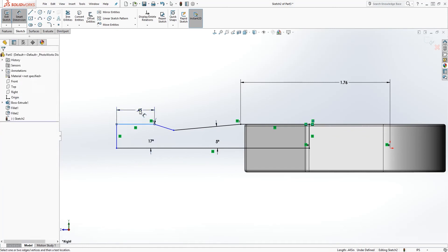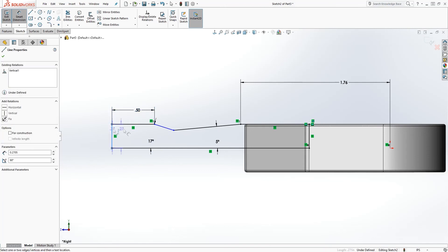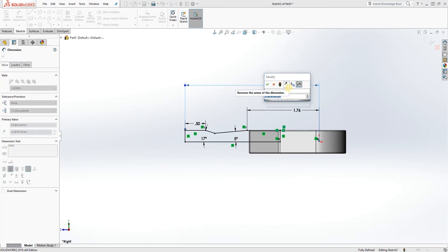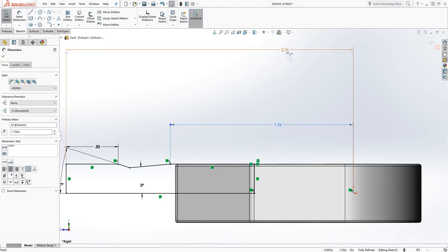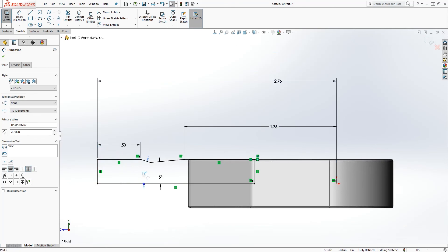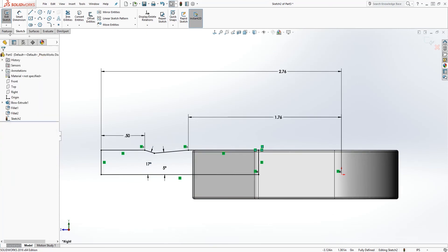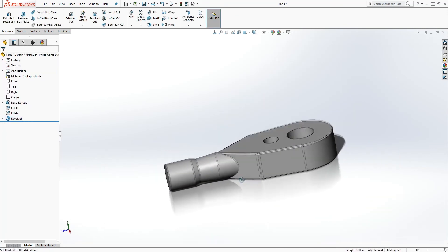The dimension for this line is 0.5, and the overall dimension from there to the center point is going to be 2.756. You should have something like this when you are done. Now we are just going to revolve that part, click OK, and that is what it looks like.